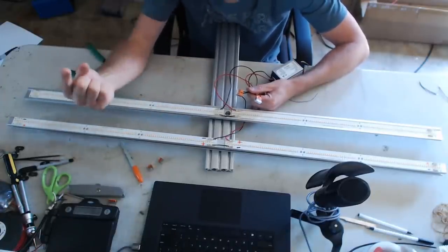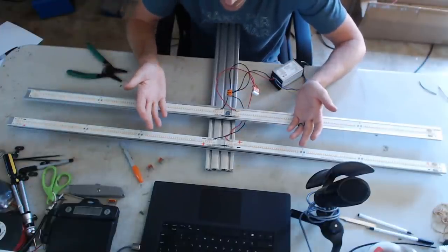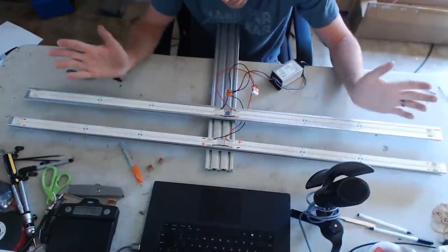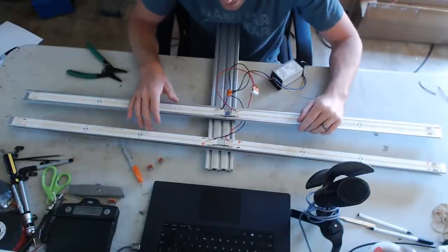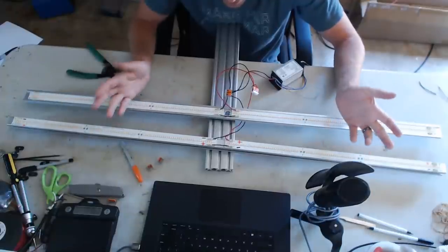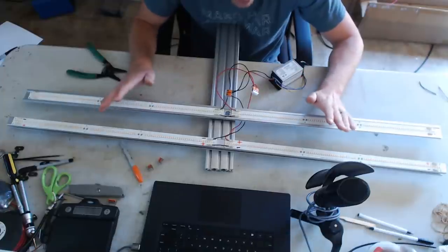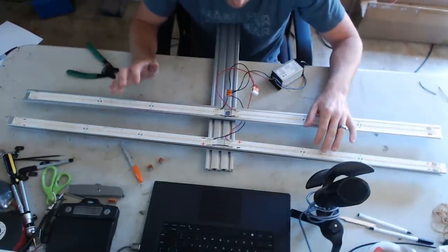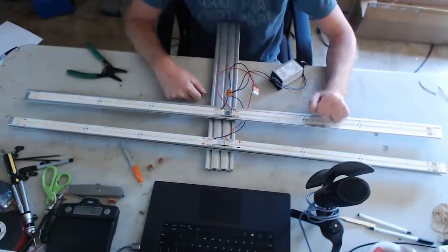The only caveat is you have to run in sets of two — you can't do a 54-volt setup with a five-strip configuration, but you can do four or six. It's the only little holdback. The HLG 600 series uses every bit of that driver, versus a straight parallel no-series configuration where you'd use a 30-volt driver and leave voltage on the table.